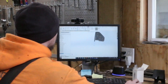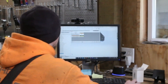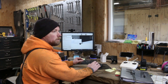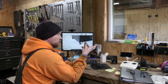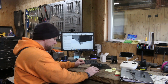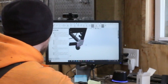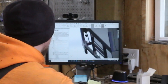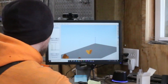Here is our custom bracket. These brackets are cool — they seem to be working very well so far. They stop movement in all three axes and won't allow twist. They're plastic, so everything deforms a little bit — they're certainly not as good as metal, but they're good enough for what we need. Now this piece can't rotate, this piece can't rotate, and that piece can't rotate. So all those old brackets get to go away and it slides right on — there it is.